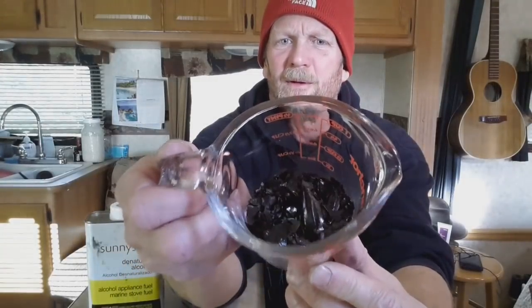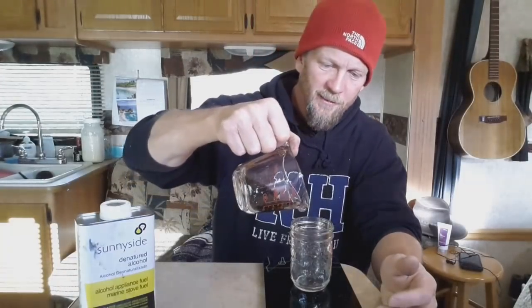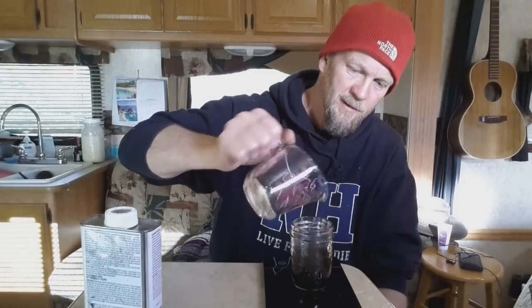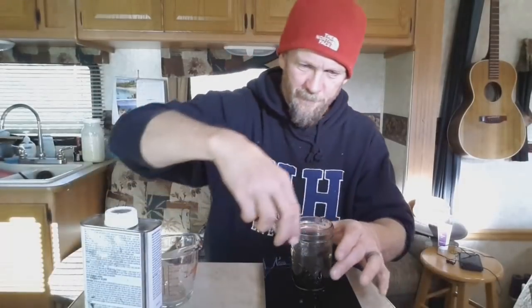They're real dark as you can see, and all we have to do is mix them with alcohol. We're going to make what's called a two-pound cut, which amounts to one ounce by weight of shellac flakes in this jar and then half a cup of denatured alcohol — you can use grain alcohol if you don't like this stuff. Pour it in and that's all there is to it. Now we shake the jar every 20 minutes and wait about half a day until it's done.